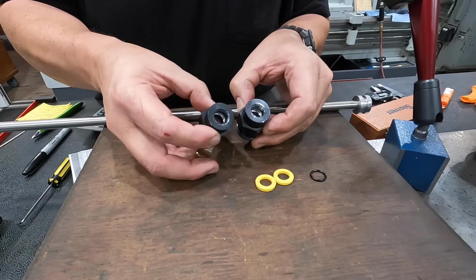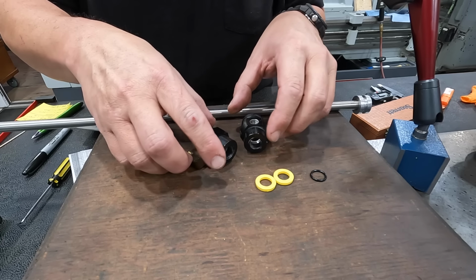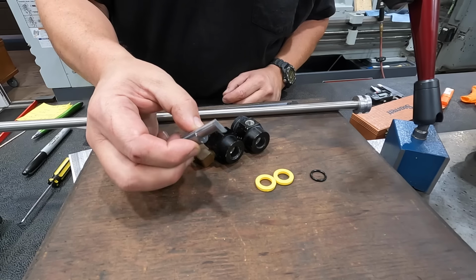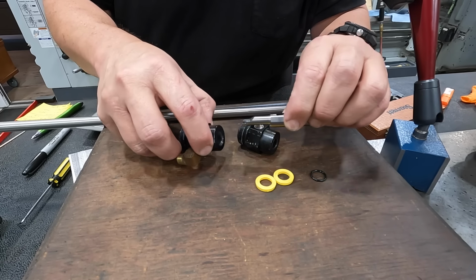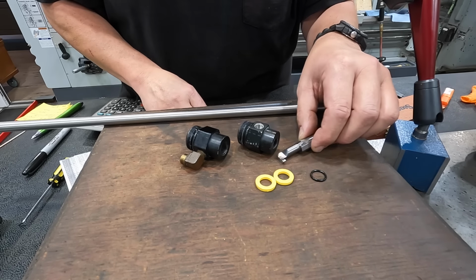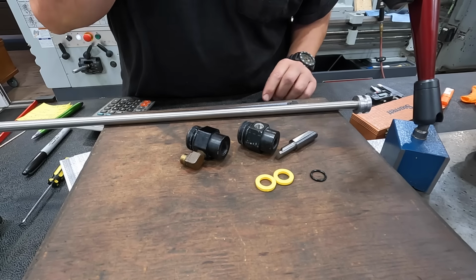All right, guys, our two rod glands are finished up. That was pretty simple, but with the right tools, it made it a lot easier than what it could have been without a DRO or without the proper tools. The Micro 100 carbide bar was really a time saver on being able to get in there and cut that without having to make a tool bit. So this will be a great tool to keep in the box. And then good use of our groove mic and our little spring calipers to get that done.